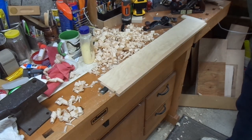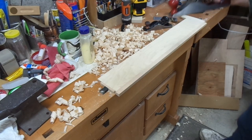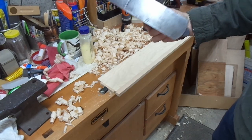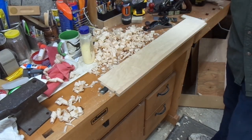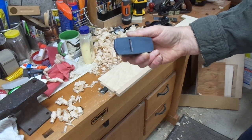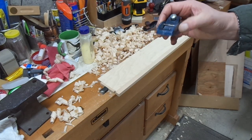I just think it's easier to put it on the bench and spend 10 minutes or so planing it. I've found a lot of success using my Great Neck plane, largely because it's just a little sharper than the other planes. I'm also using this number three that I did a video on recently. I also use the spokeshave, which has worked pretty well. I think any plane will probably do as long as the iron is really sharp.